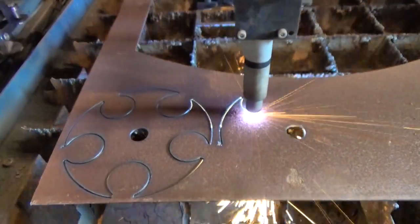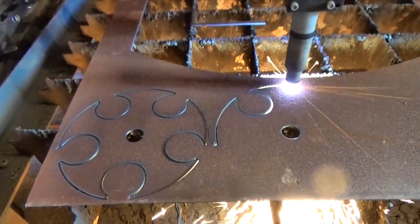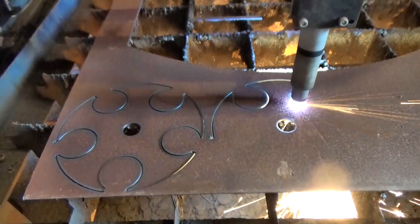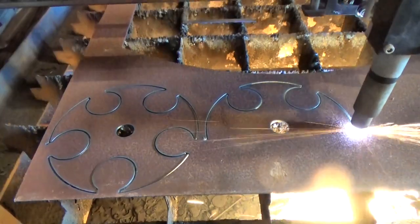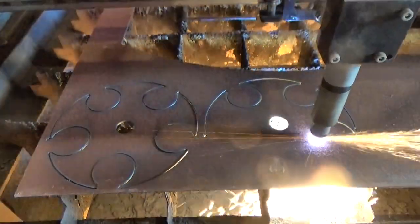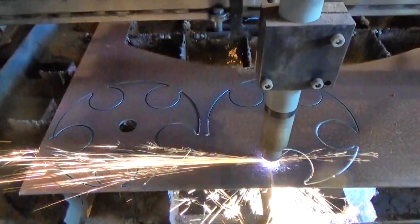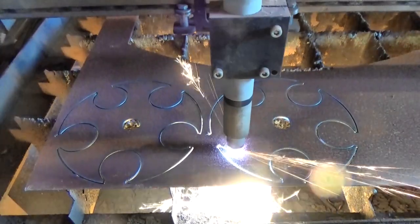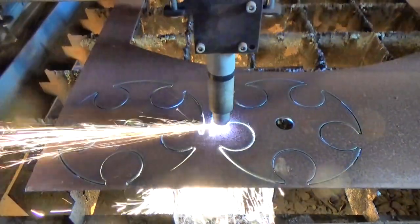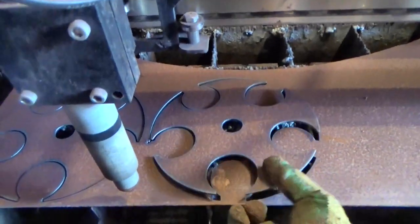The doughnut parts that fit into the pipe could be cut with an angle grinder — just make sure the axle holes are in the middle, obviously. You'll have to forgive me for using my marvellous CNC machine for this, but I'd be silly not to, right? These could be solid circles with a hole in the middle if you were going to paint yours, but I might get these galvanised, so I need to add some holes to let the molten zinc out while they're being dipped. Watching this is strangely hypnotic, isn't it? Link to the machine in the description.